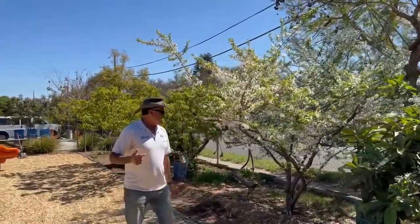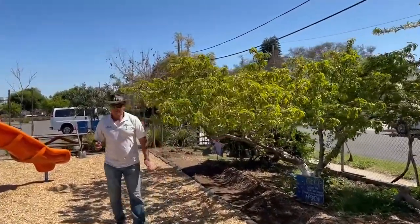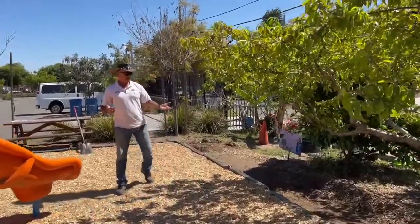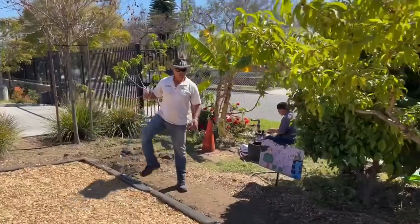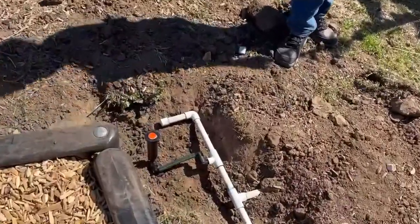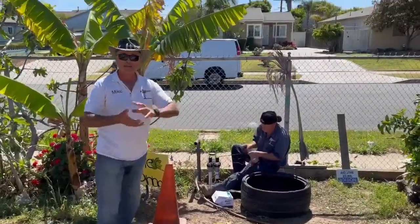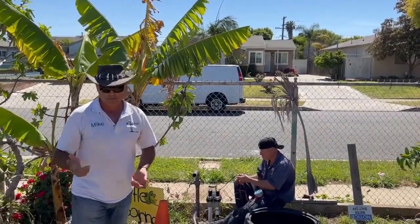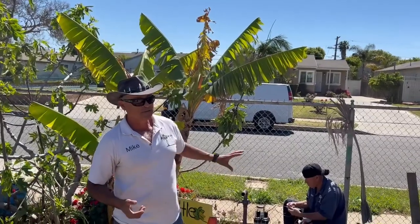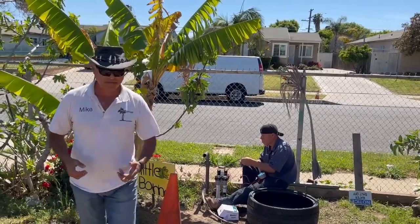If you're going to think about doing this at your local school — whether it's a high school or in this case a middle school — you need to know a little bit about irrigation and plumbing. I'm going to show you how the plumbing is put together. See that's the sprinkler right there where we installed them. We're going to cover all this pipe up so it's all going to be underground. We have a sprinkler timer — it's battery operated, takes two nine-volt batteries, just like a regular timer. The reason we're using that is because there's no electricity out here and a normal Rainbird timer needs to be plugged in. We also have the copper line that we tapped off of, and that's where we ran all the irrigation.